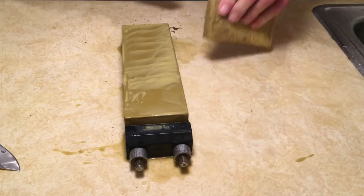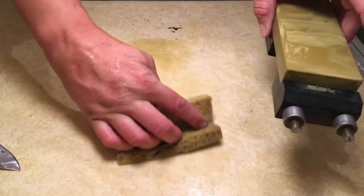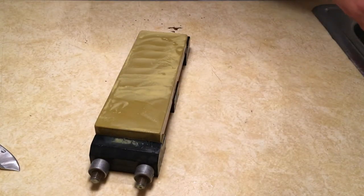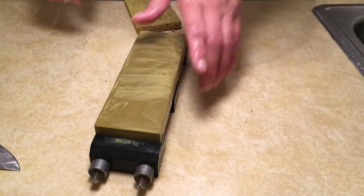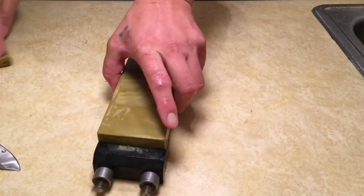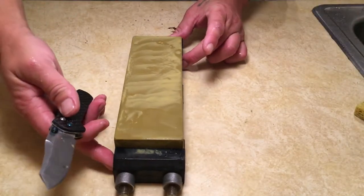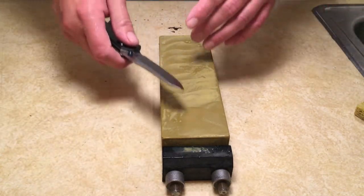So how do you know when you're done on this stone? Well, this one's going to be mostly aesthetics. You're just going to look at it and keep sharpening on it until you get those scratches where you want them. This stone is going to take the scratch pattern we got from the 2000 and brighten it up. We're going to get a nice luster from it, and we just want to make sure we get that luster even